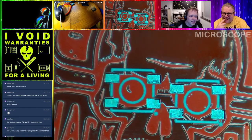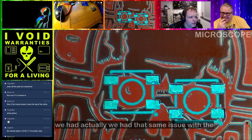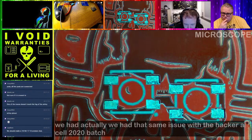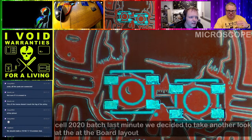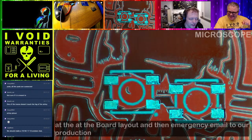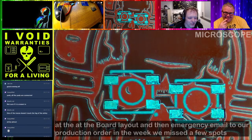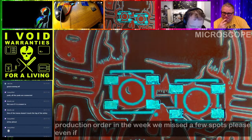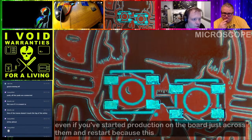We had that same issue with the Hacker Hotel 2020 badge. Last minute, we decided to take another look at the board layout, and then sent an emergency email to our production partner saying, "Hey, we missed a few spots. Please, even if you started production on the boards, just toss them and restart because this won't work." There were dead shorts in there, so that's the same here.